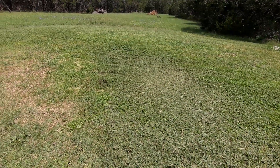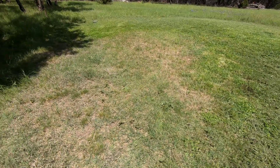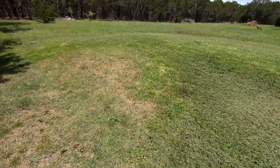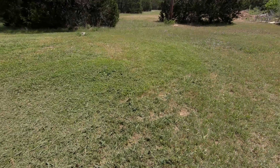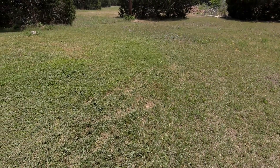It looks like my drain field isn't leaching into the ground properly. I have this big dry spot here when the rest of the drain field is lush and green year round, and in some spots it's bubbling up all the time. Last year I opened up the ends of the lines down here and blew them all out, so I know they're not completely clogged, but at least it is in one area.